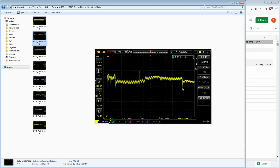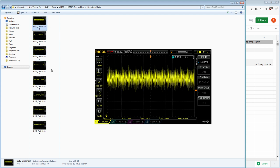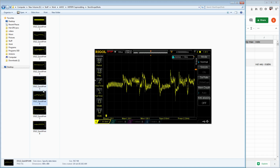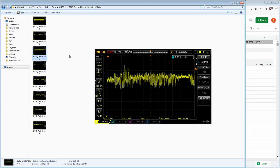And again, we just have a mess throughout everywhere. Then we have this right here, which, oh, idiot me didn't take a nice sample of the partial zoom. Yeah, idiot me. But for some of the other measurements, there's basically a part of the frame render cycle, which is just a disgusting mess that looks like this. And this disgusting mess is also very high peak to peak. So we can probably clean this up with some more capacitors as well.